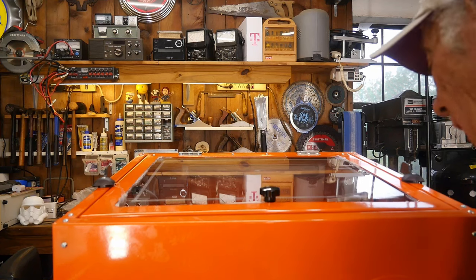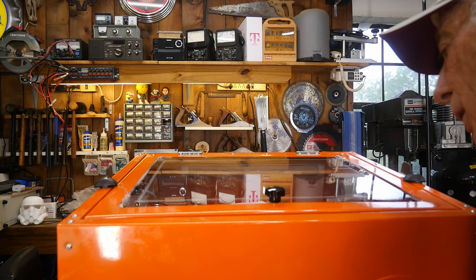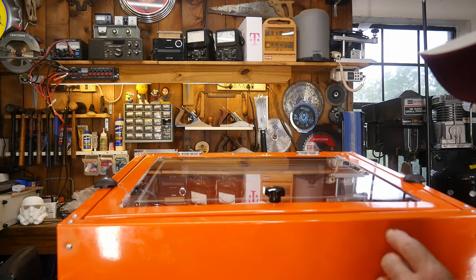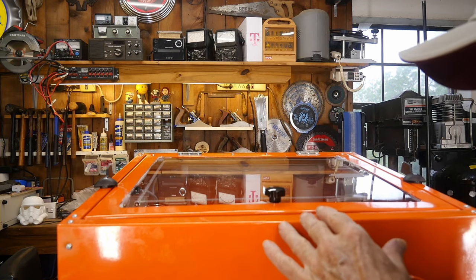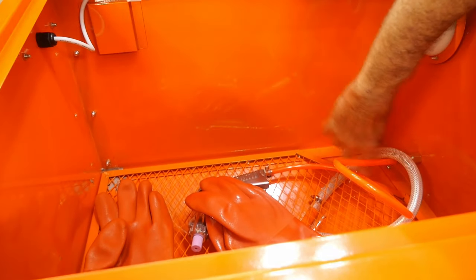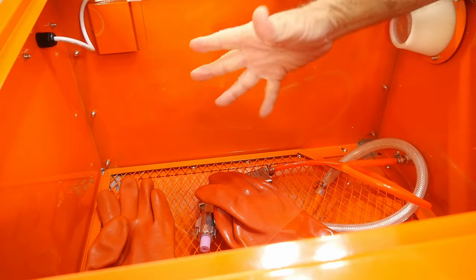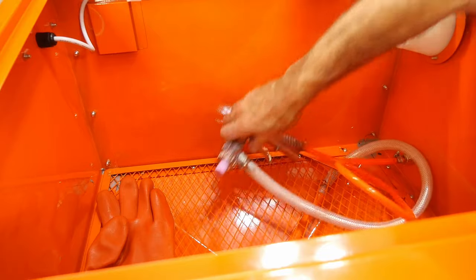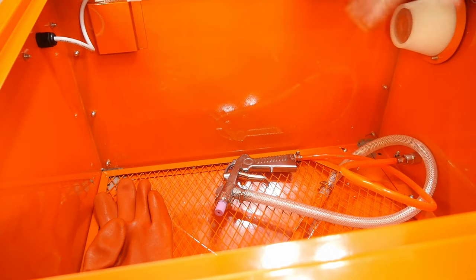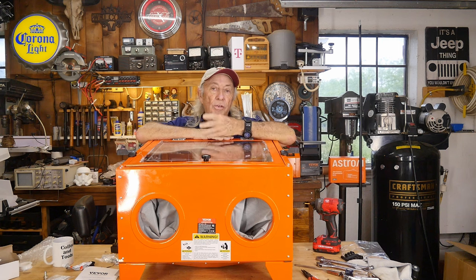What I'm going to do right now is fire the gun off on the inside of the machine. Watch the top of this glass — you'll see how you're introducing pressure into the box itself. When I hit the gun, you can see the glass is actually raising up because you're introducing so much pressure inside. I wanted to give you a quick inside look — this is the open angle area of your cage, so your line goes down through there, there's your pickup tube, the steel tube lays down in there with the sandblast media, there's your gun, and you can see how it's all hooked up and goes together inside. There's that filter acting as a pressure relief valve, plus the light.